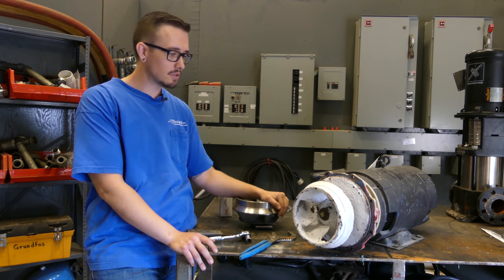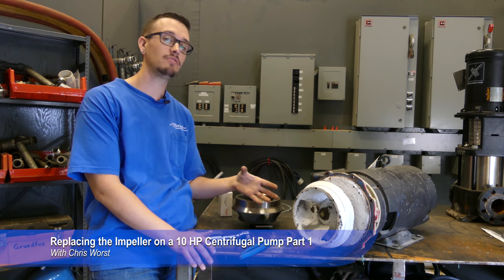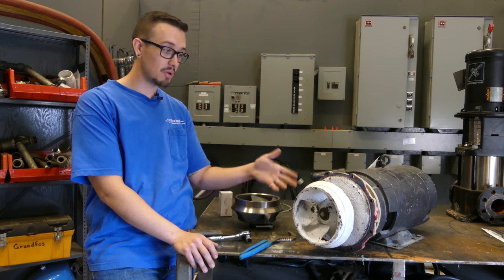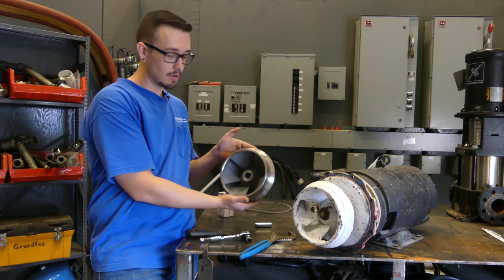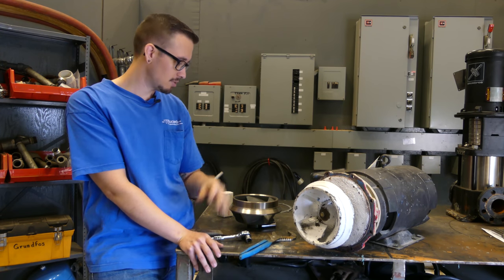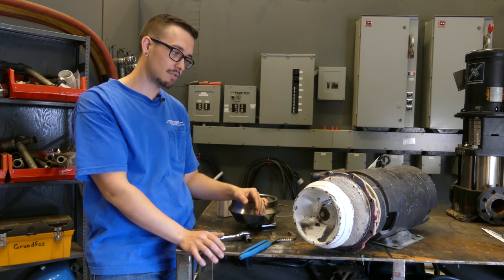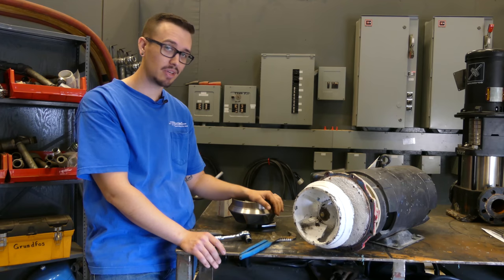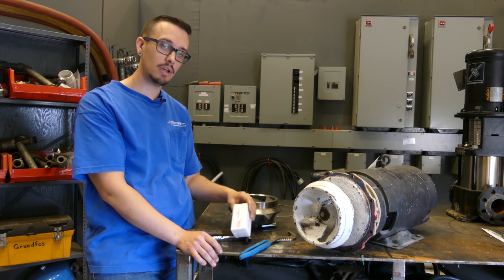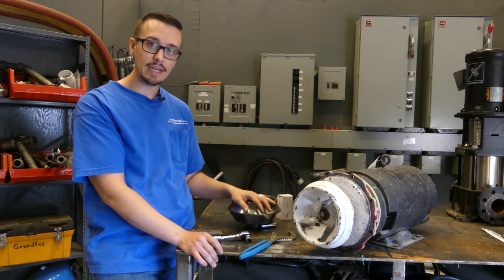All right, so here we are back again, Chris with RC Worst. Today we're taking a look at a Berkeley 10 horsepower pump. This pump has an odd application — it's used specifically to pump water for a water slide. Somebody around the lake has a big piece of property and evidently a big water slide. We're going to replace the impeller, which has a lot of cracks and is broken in places. Oddly it's been painted. We've also got a gasket to replace, which goes around here and allows us to attach the volute — that's probably 60 pounds, a big heavy volute. It's about a 9 by 6 inch discharge, so a pretty large pump that moves about 400 gallons a minute. We've also got a new seal to replace.